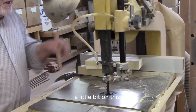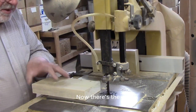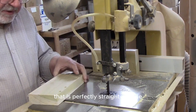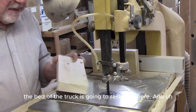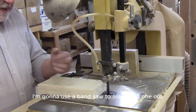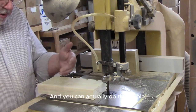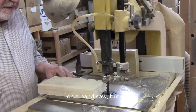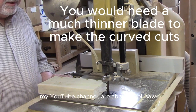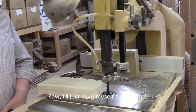I'm going to cheat a little bit on this. This is inch-and-a-half thick poplar and cutting it on a scroll saw is a little bit on the slow side. The bottom was deliberately placed on the side that had been ripped on the table saw, so I know it's perfectly straight, and the bed of the truck is going to rest there. I'm going to use a band saw to make that one cut - it's faster than the scroll saw and it'll be a straighter line. You can actually do this whole cut on a band saw, but my channel is about scroll saw, so I'm just saving myself a little time.